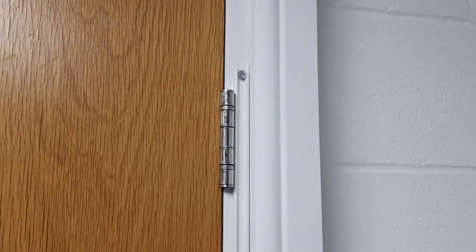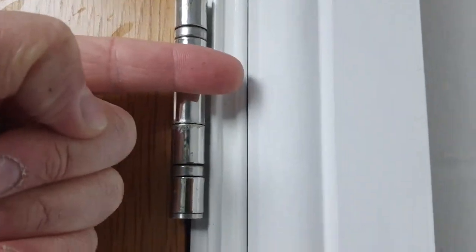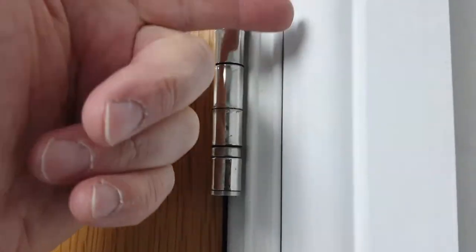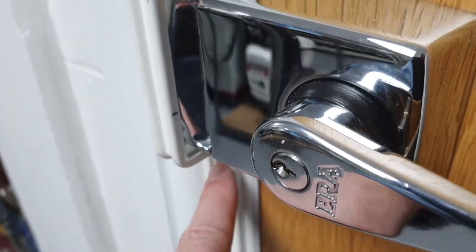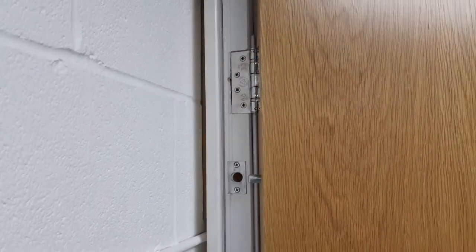That's where the Birmingham bar comes in. The Birmingham bar is a steel bar of the same construction as the London bar, positioned right next to the hinges. The screws are hidden beneath the bar, and the bar prevents those screws from splitting out — making the hinge side of the door frame much more secure and resistant to physical attack. Occasionally we fit the Birmingham bar on the latch side too if there's no night latch requirement, so both sides have a bar.